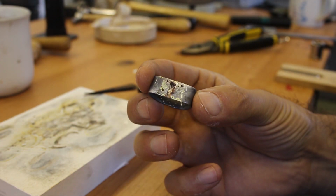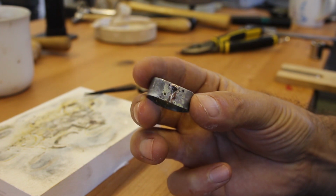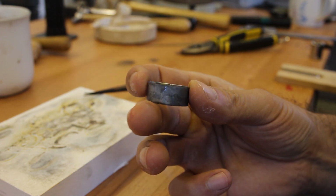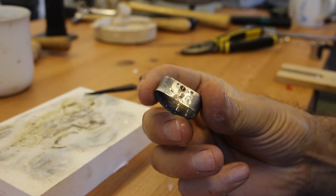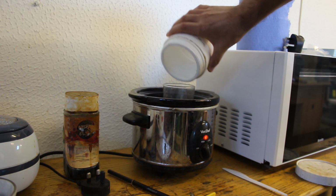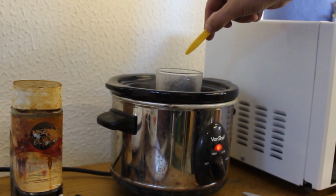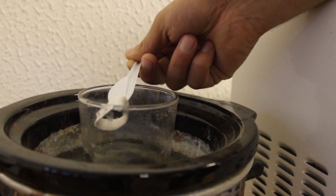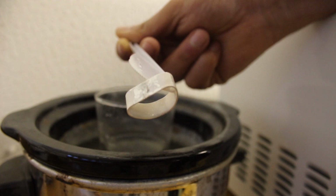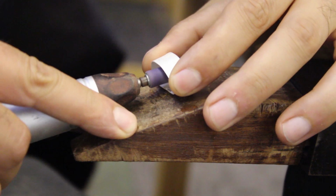After soldering, the piece was kind of all oxidized and there were big clumps of caramelized flux all over the place. And so to clean that off, I used a mild acid solution called pickle, which you just put in warm water and leave the piece in the pickle for, I don't know, 20 minutes, and it comes out nice and clean.